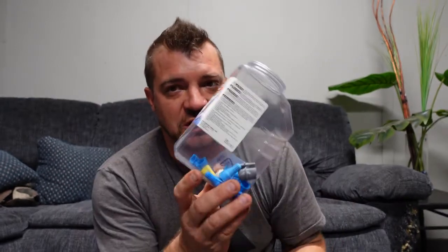Basically we have four major groups. The smallest would be our 331s — we call them 31s for short. They're a small orange wire nut or wire connector. Next up would be the 333s, or 33s for short. These come in blue and yellow, two major types. These are the most common ones that we use. The yellow one has twist-on side arms to get better torque.